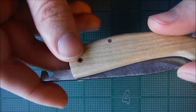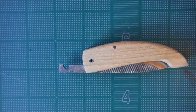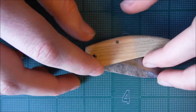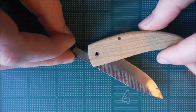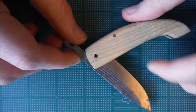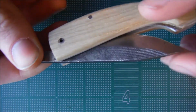So I heat treated the metal in an oven for like 6 hours at 450 degrees, and that softened the file so that I could file it. So I used my filing jig and filed away at the file to get this shape. Well, before that I took an angle grinder and cut this, and using numerous files to make that groove in there and make this back piece here.